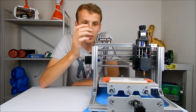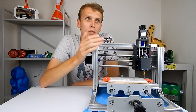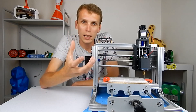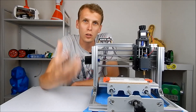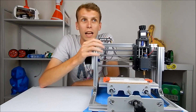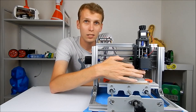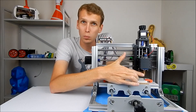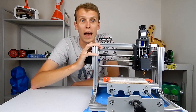But if you're looking for something with a specific purpose — cutting through thicker plastics or actual metals like aluminium, brass, and copper — don't go with a low-end machine like this. Look at the collet that is holding the bit. If it is that little brass connection piece, avoid it. Run for the hills and find something else.